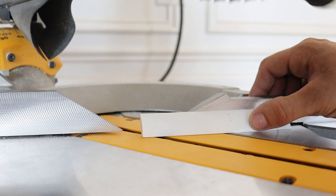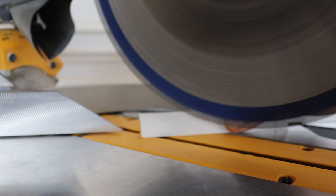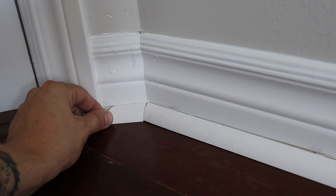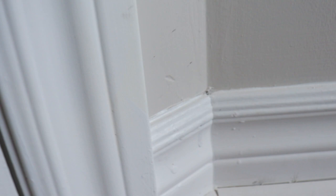Make sure to wear safeties for something like this because pieces can come flying at you at the very tip. Almost every time you're going to have a little bit of extra shavings to peel off. Okay, back in the bedroom — put the piece in, it lines up nice. Come over to the corner with the small piece, butt into that corner, and you have a nice closed seam. Take that little piece and just pop it into the corner right here — makes a really clean end cap.